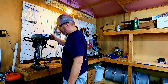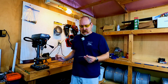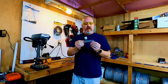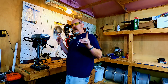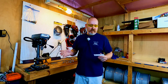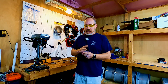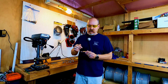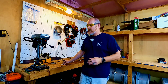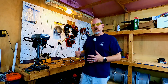Let's drill out this hole. I'm going to use my 25/64th drill bit and we're going to drill two holes in this one-inch flat steel so we can bridge the two ends of the dipole on the shield side. I've marked it five-eighths inch in from each end and since it's a one-inch piece we're going to make the hole at a half-inch so it should be right in the middle. To keep the drill bit from walking, we're going to hit where we want to drill with a punch to give it a little indentation for that drill bit to start.